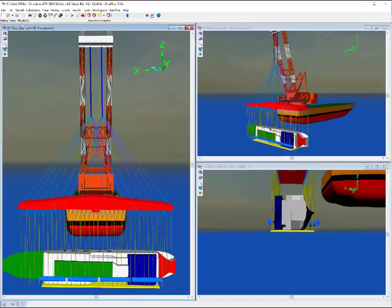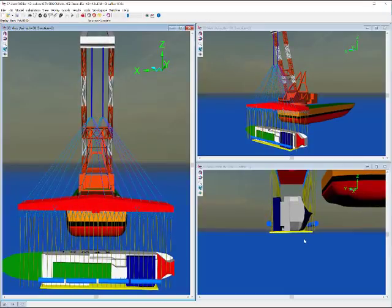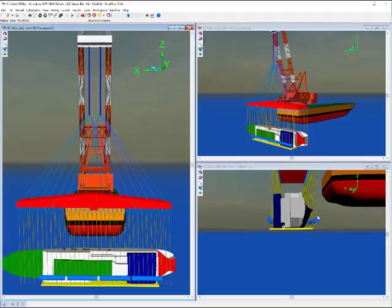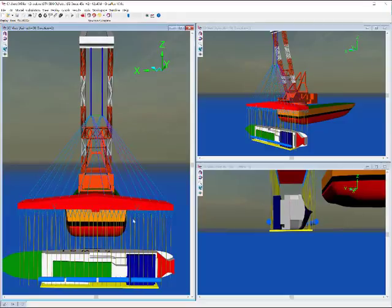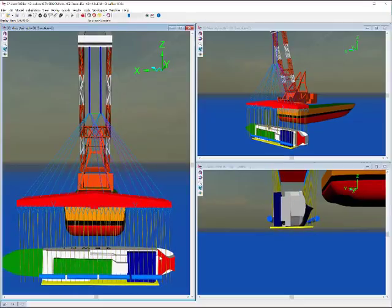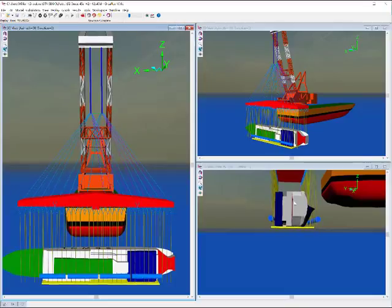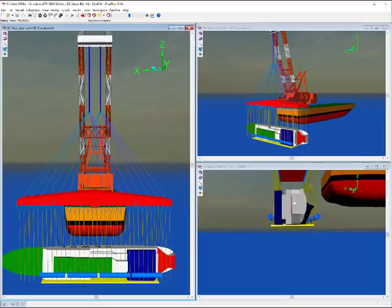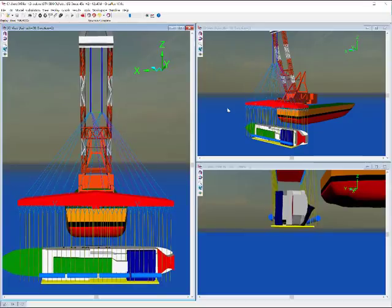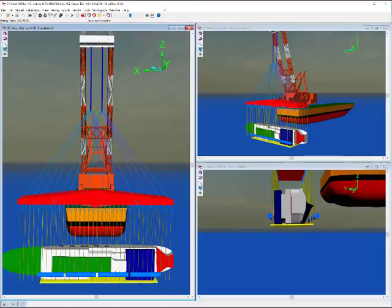We're still swaying around, but now that we're taking load the frame is less violent in its motions. You can still see slight sway — we're playing at real simulation time. We're slowly raising, and we see the seawall with some motions. We realise those motions must be causing dynamic forces. The frame is roughly horizontal with the seawall but there is slight pitch and slight roll motion for this particular load condition and this 12 second 45 degree wave. One gets an idea of conditions you really want to avoid and not let be unpredicted, so that you get another accident.